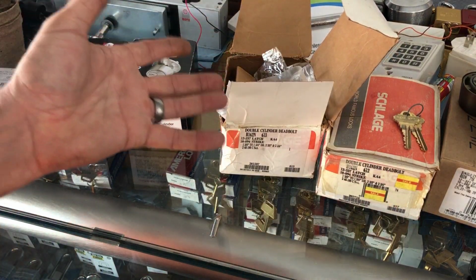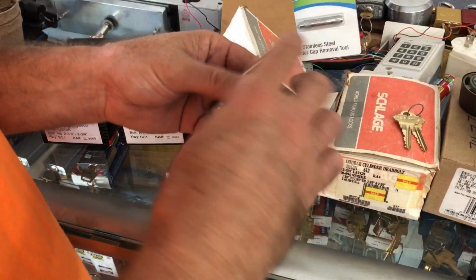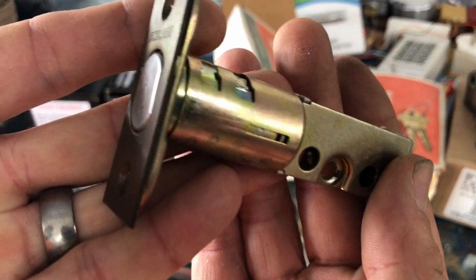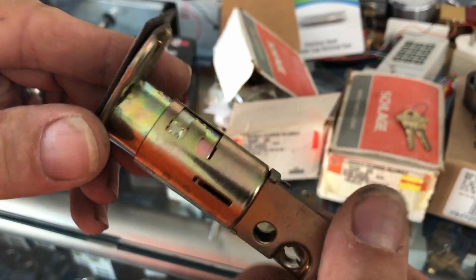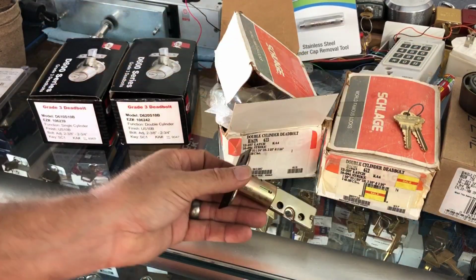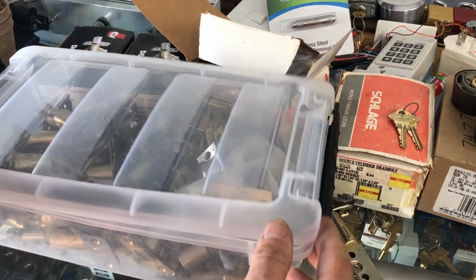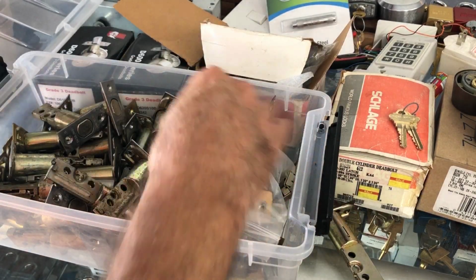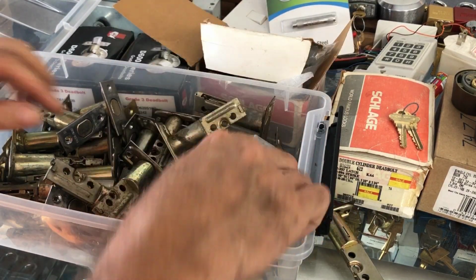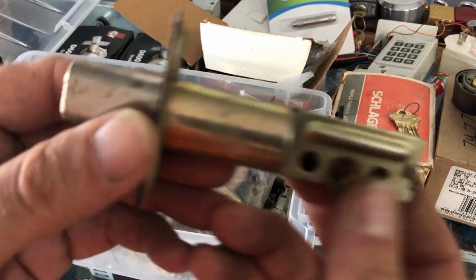But with the regular B160 deadbolts, which are on millions of homes still in operation, we have this latch. Now, before the adjustable came along, where you twist it to adjust it, you had just a fixed latch only. And the fixed latches were much better, in my opinion, than the adjustable, and in a lot of other people's opinion.